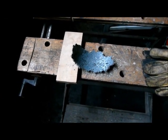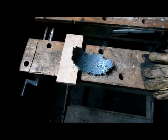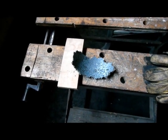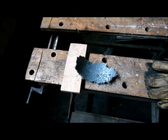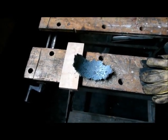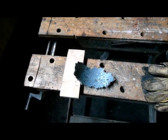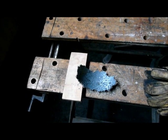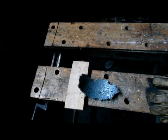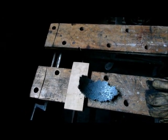First of all, when I put the insulation between the heat riser and the insulation shroud, I really packed it down tight. I took a 2x2 and went around and around and packed it down as tight as I could get it. And when I took things apart, the insulation had disappeared enough so it had settled at least 8 inches from where I left it.